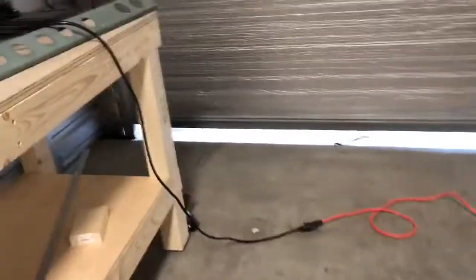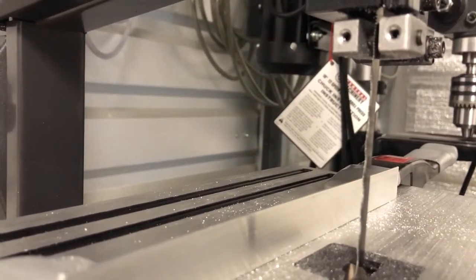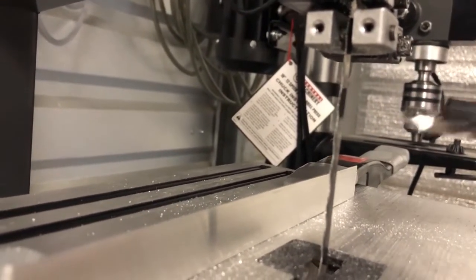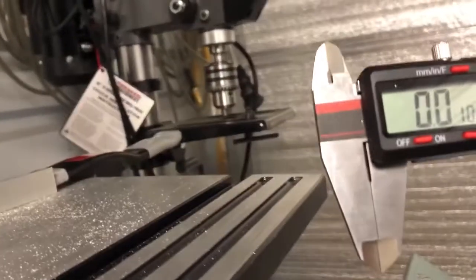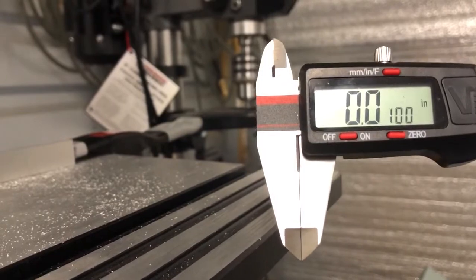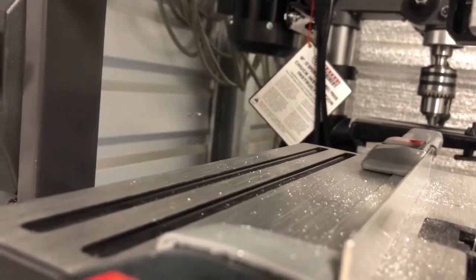And like I said, the problem is the blade has a ripple. I'm trying to catch it. See how that blade has a ripple? It's not perpendicular, so you've got to account for that as well. I didn't do that, so this is probably deviating. You want to take the blade diameter and double that, and that's about how much off I am, or actually you would triple it, because if you think of it like a sine wave, it goes up and then down in both directions. So you're looking at a deviation. I'm well within the cut for that blade.